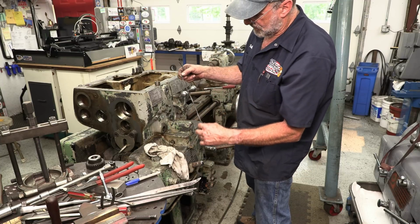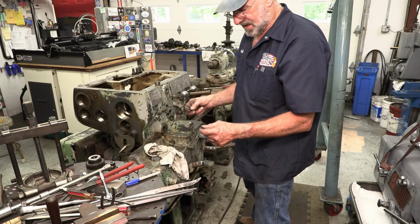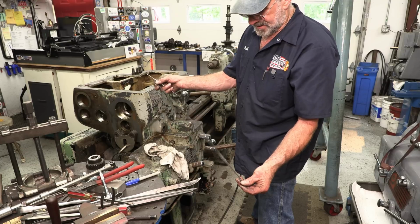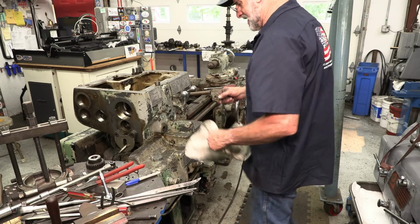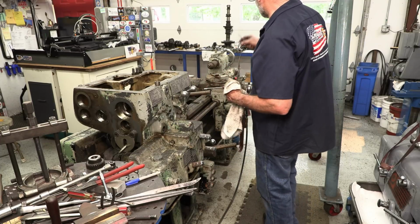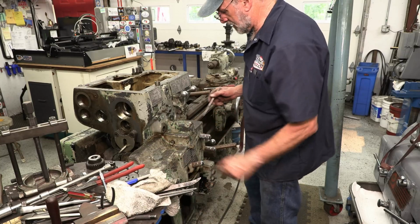Usually packing is one roll one way, one the other way, one the other way, and you mismatch your split lines. You never find this in a boat wrapped up like that. Well, I'm not saying you won't find this in there. It's not supposed to be done like that. And anything that's been done by a first-class yard won't have packing wrapped like that. That's not how it's done anymore.